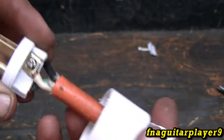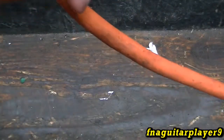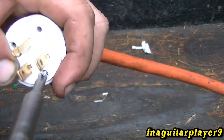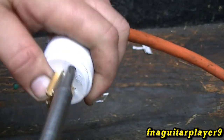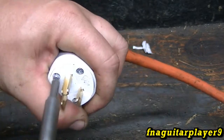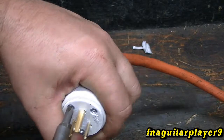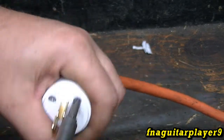Once you get all your wires in there and make sure they're secure and tight, you're ready to go ahead and install the plug body. That's where I was talking about — it lines up right. If you don't line it up, you're going to be fighting with the screws trying to get them to go in. Get one screw started first, then you should be able to get the other two going. You want these pretty snug but don't strip them out since you're going into plastic — you'll feel it kind of bottom out, so just snug it once it does that.